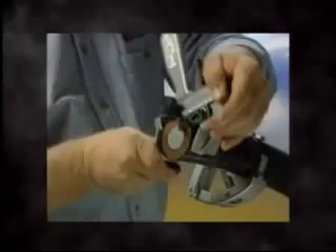Slowly feed the tool by applying a slight forward pressure to engage the blade. Continue stripping by applying this forward pressure until the proper length of insulation is removed. End stripping of secondary voltage outer jackets or spacer cable is performed in the same manner.